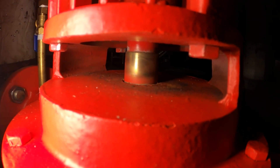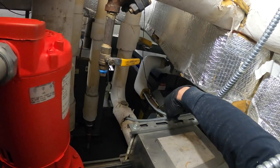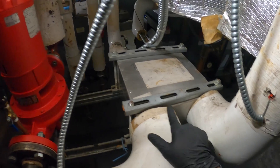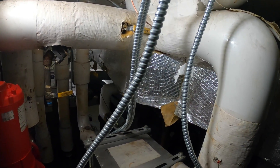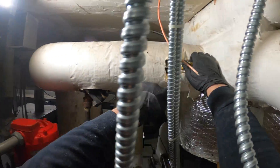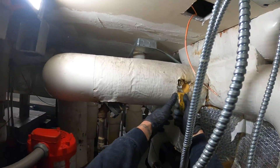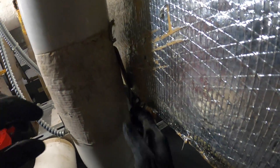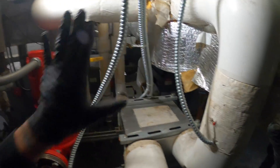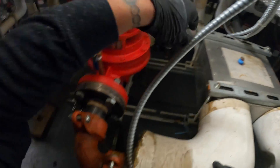The pump is no longer spinning, we are good to go. This is the heat exchanger — got two pipes going that way in one direction, and then we have these two pipes which are the inlet and outlet of this heat exchanger connected to this pump on a separate loop. That water doesn't mix — they're just exchanging heat through the heat exchanger. So let's close this one pipe here, make sure that's all the way closed, and then the next one. Now these two pipes are isolated.